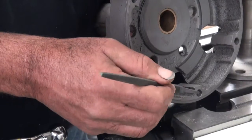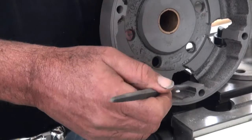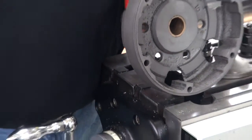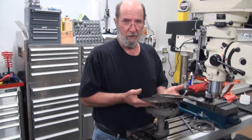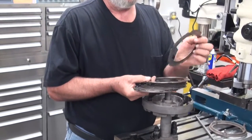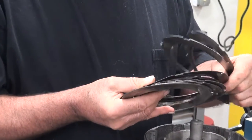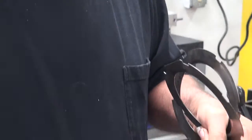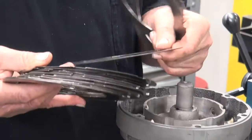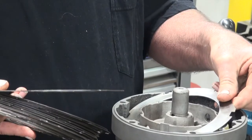So if I had a decent drum, I would go around here and file down all of these edges so I could stand a chance to get a good neutral. Henry Ford, as he supplied our transmission, used a series of 25 steel discs. There are 13 large discs and 12 small discs. The small disc is what comes in contact with what I call the clutch basket, and the large disc makes contact through the lugs on the brake drum.